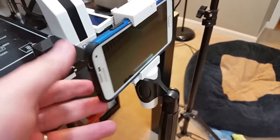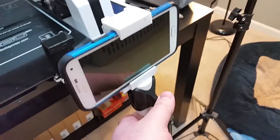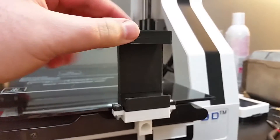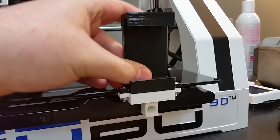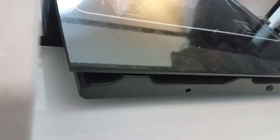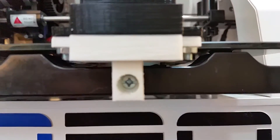This right here is the old way I used to do it — it's just on a tripod or mic stand overlooking the printer, and as you can see as the bed goes in and out it does not work very well. But I took this same clip and made another one and actually just mounted it on the front of the printer. It's very very sturdy so the camera doesn't wobble at all while printing. On the back of the printer there is a little screw that holds a belt helping the bed move back and forth, and over here there is a little hole that is not being used, so I decided to leverage that because I had some screws that fit it pretty well.